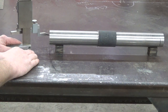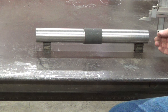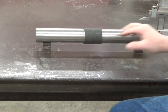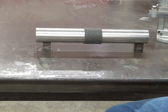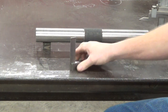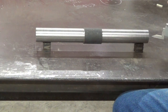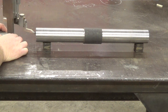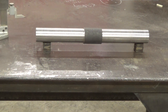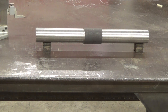I'll transfer this line here onto this end. I have this line on each end, vertical now, and perfectly with the square. I used a machining square against this piece of half-inch plate table top. We'll come across here and we will scribe, and we'll scratch a line there. I'll get a center punch and we'll center punch those, make them bold, and then I'll figure out some method to center drill them.